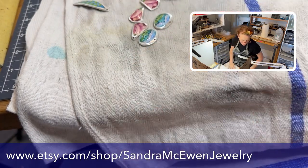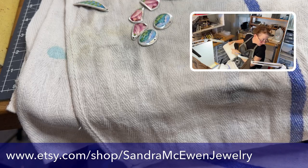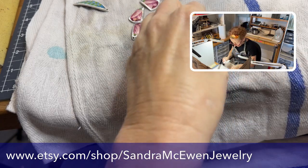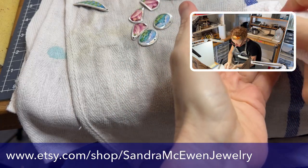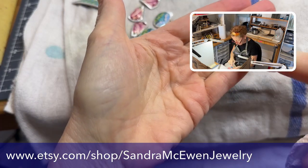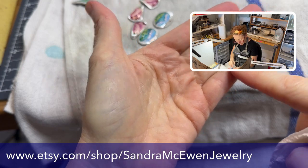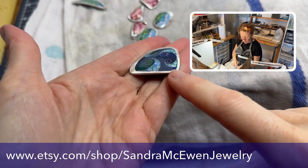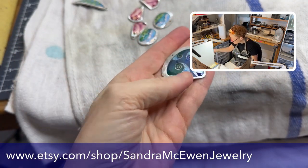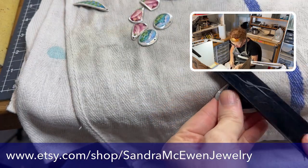Then if you want to see where you are, you can get some dry paper towel and dry it off. And what I'm looking for is no shiny bits. I see I've got a little bit of work over here. See how it's nice and matte finish, except for in this little area. So I'm going to really focus on getting these little divots out.